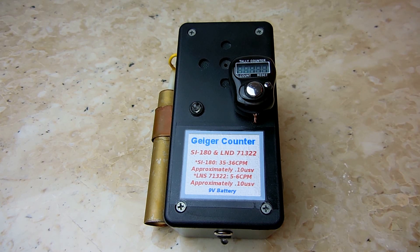The count is very accurate unless the source of radiation is very hot, in which case it may miss a few counts — which is why you want an optocoupler with a very fast response and short recovery delay to avoid missing counts. Now we're back to normal background radiation. Watch this thorium mantle — this thing really goes fast.